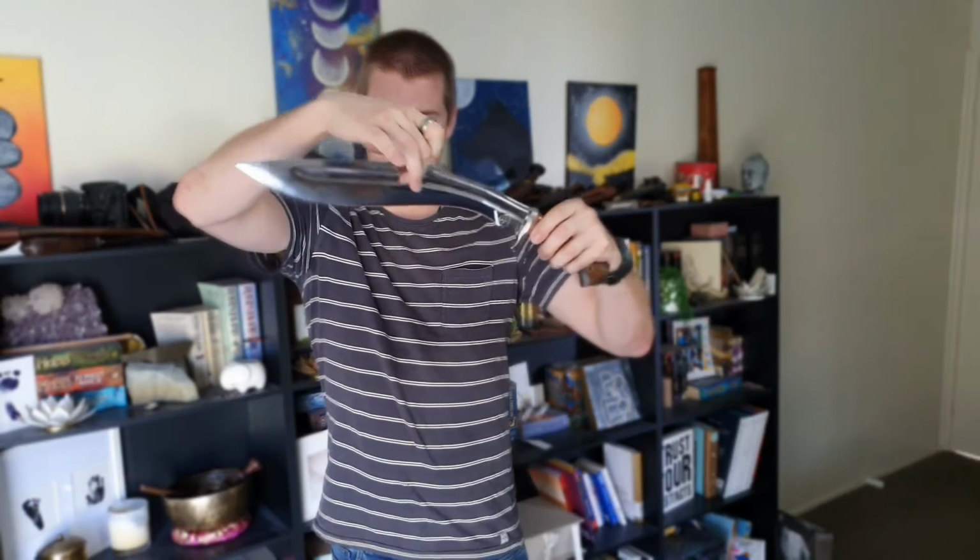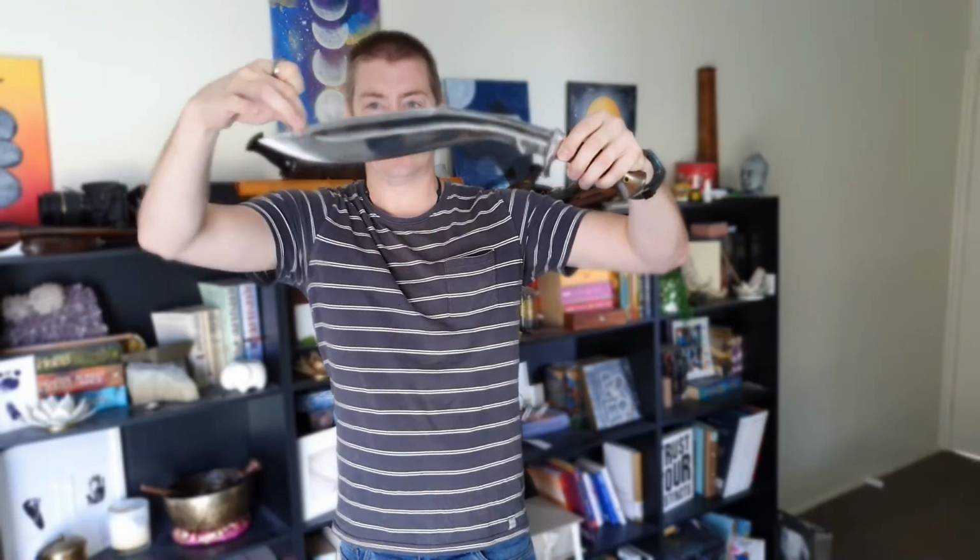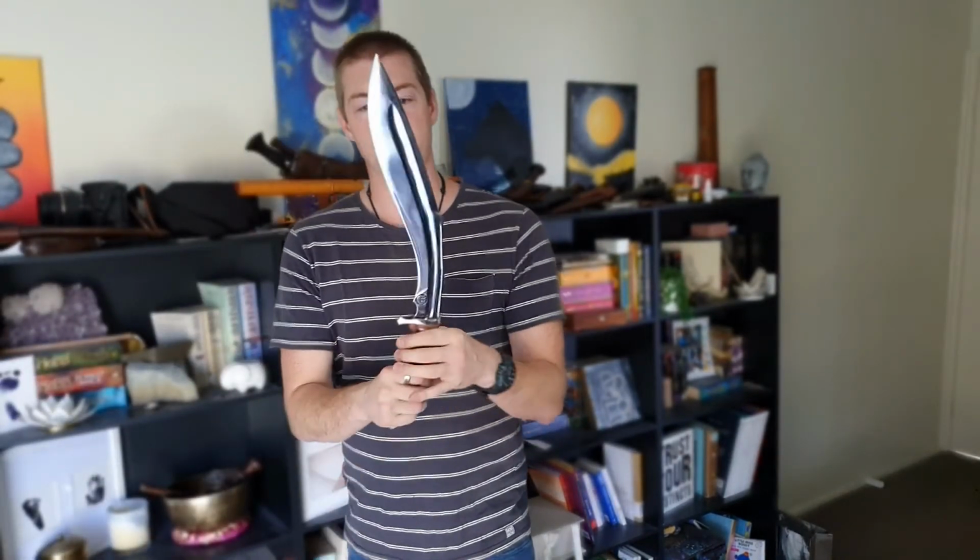So you've got a beautiful fuller all the way up the length of the blade. You've got a stepped spine. So the spine is about 6 mil thick, 5 mil thick, till it hits this point, and then it actually becomes even thinner as it comes out there. You can sort of see it in the profile. In this particular view, you can see the distal taper to the tip is very, very fine. The reason behind that is because all your heavy chopping is going to be done back here. This is for your machete work. Or if you're going to be using it for martial arts purposes, that's your super slicey stabby bit. For your thrusting, and let's not get too much into that because that's not why I design these things.